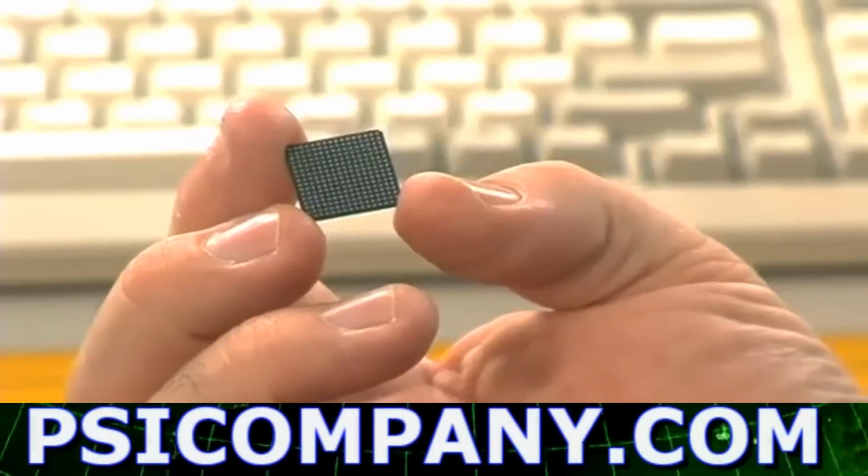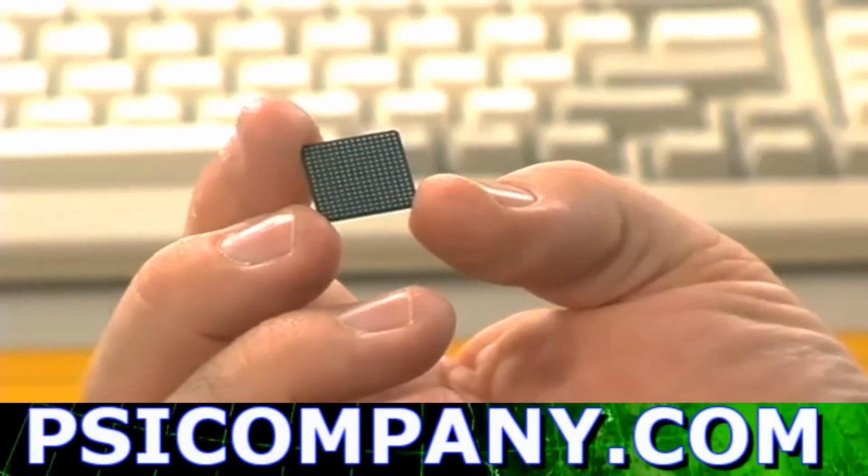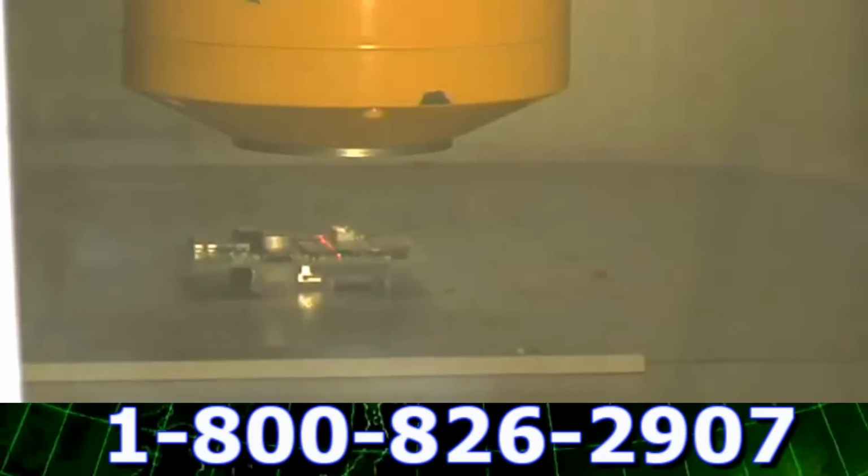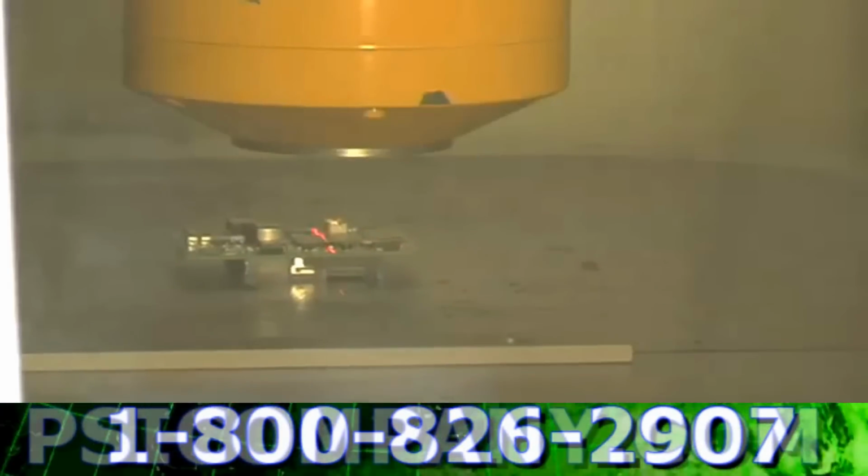And then there are some of the components that are extremely small, or the solder points, the ball grid arrays, are on the back side or buried in a way so that we can't visually inspect them. From ACR's point of view, we have to be able to ensure that those solder points are all perfect. So we have a PCB X-ray analyzer. You could say we X-ray our solder balls because we have to.